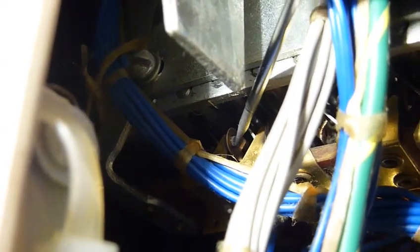Let's see — this one over there is 2, this one over here is 4. And indeed it's stuck. A normal contact goes up and down, but contact 4 is stuck. So I read the schematics properly and found the fault.